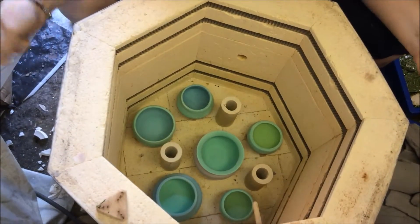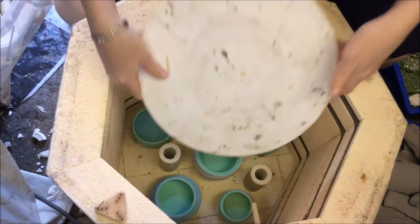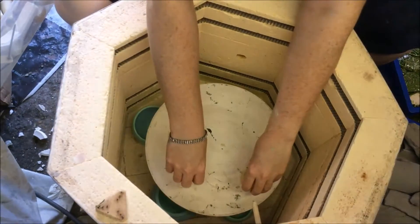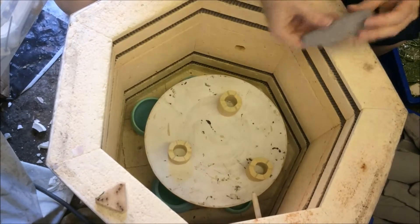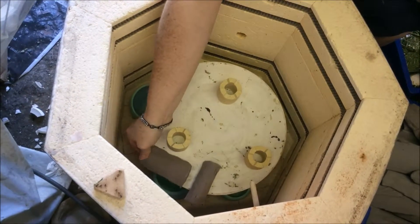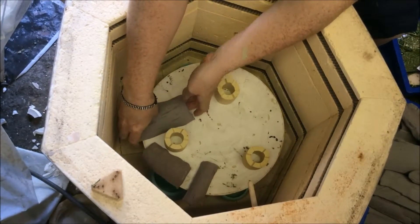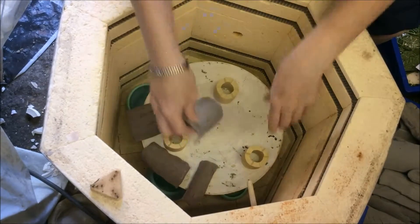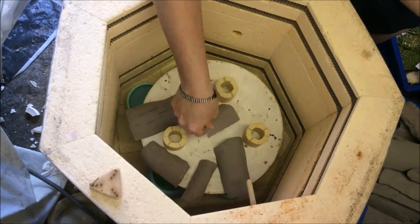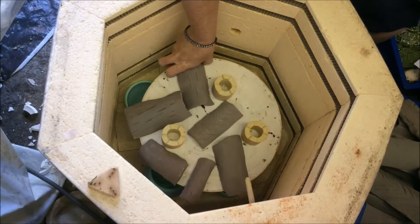So now my first layer is ready. I can put my kiln shelf on. This one's got horrible bits of glaze on it — I need to clean it off and add some more covering. Now I can start to add pieces of your bark. I need to get on as many as I can because we've made about 300 or 400 pieces of bark. I've got to make sure I can fit them as cleverly as I can to fit as many in one firing as possible. It takes about 12 hours for the kiln to be fired before I can open it up again, and it gets up to about 1060 degrees for this firing.